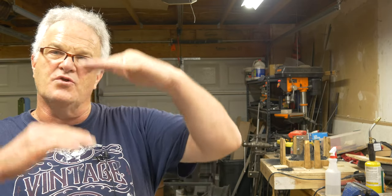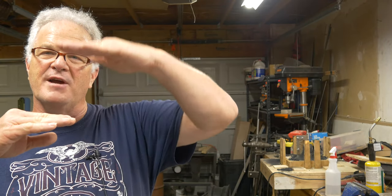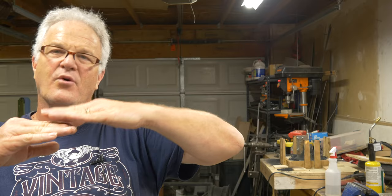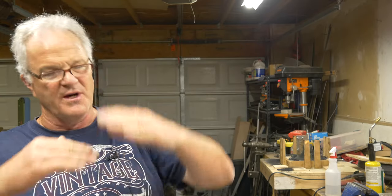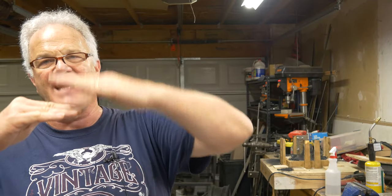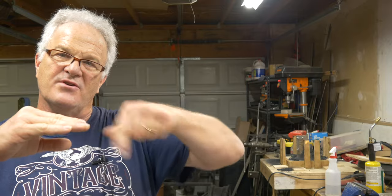And we're going to demonstrate that in the pour. I'm going to demonstrate that in the pour really well, I think. But this idea that you have sort of this grace period, if you will, of metal above that ridge, that you're pouring can come in and you can pour quicker or slower or whatever, and you have that sort of dampening effect of the metal while you're still sealing off the top of that sprue and not letting any air come down. So it's a great mechanism for two things.